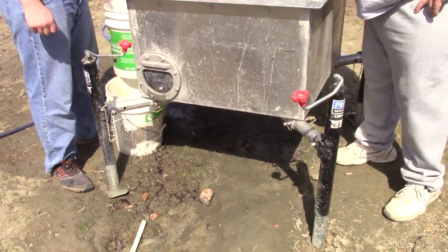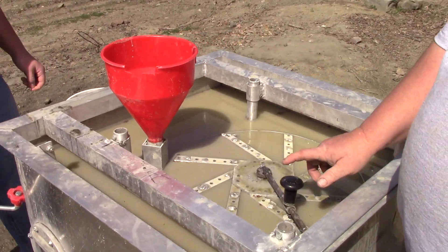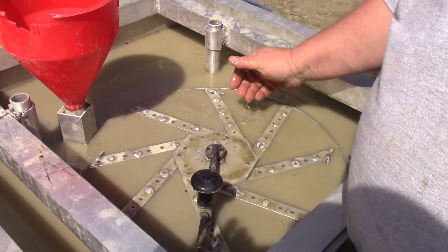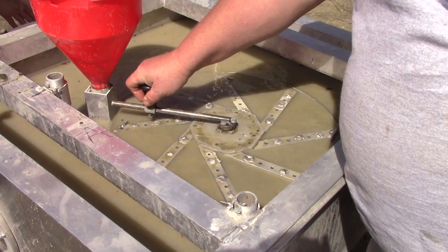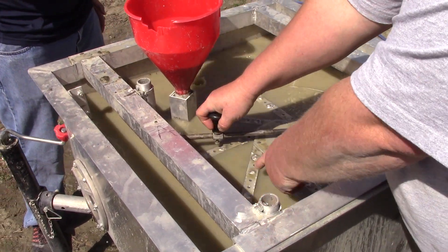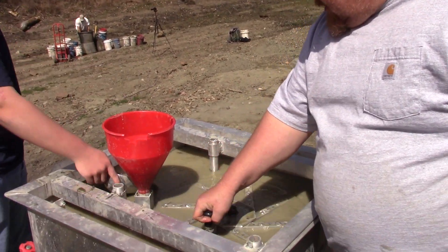Aluminum is lighter and you've got legs for leveling it. Is it important to have it level? Oh yeah, you've got to have it level — not really so much for the trommel, but for the surface stuff. I can see your water is level, and that's what you could use to figure your level. This is a device we made — it's only about four inches deep. It's got these fingers that stick down in there. It's kind of based on the wash plant out in front of the visitor center — an African-style rotary wash pan. As we sit here and turn this, it feeds material in on that side, and it actually dumps in there and goes out in the middle. There's a tube in the middle with bearings, and as the material works its way in — because the outside is higher than the inside — it will work its way to the inside.